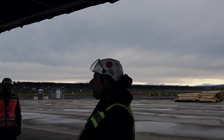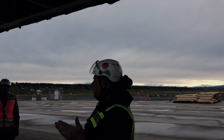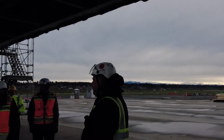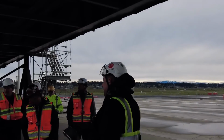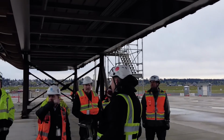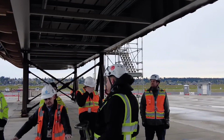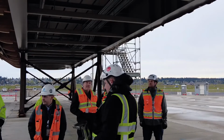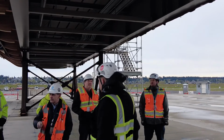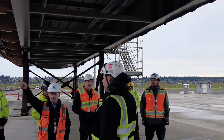Based on all the lift recommendations, you're able to get some type of lift to any part of the roof. You can drive the lift down there. You'll just potentially have to put spreaders underneath the outriggers, particularly if you haven't extended all the way over, at max load. But you can drive the biggest lift wherever; you just have to use spreaders when you go to use them.